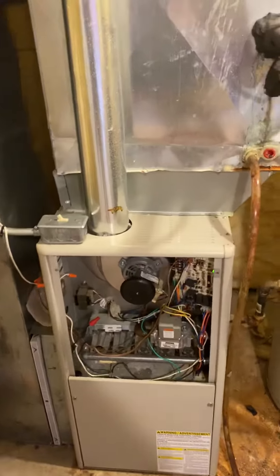This seam right here is 21 inches wide, and from the seam to the top of the furnace it's 34 inches tall. We've got a 4-inch going into a 5-inch, tying into a 3x5x6 T up here at the top.